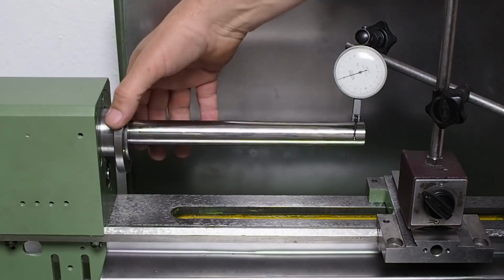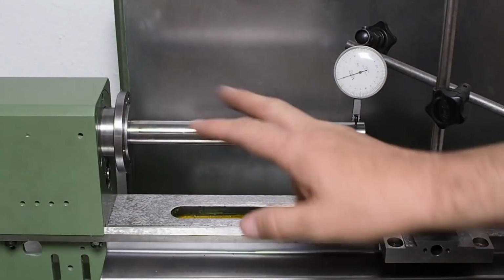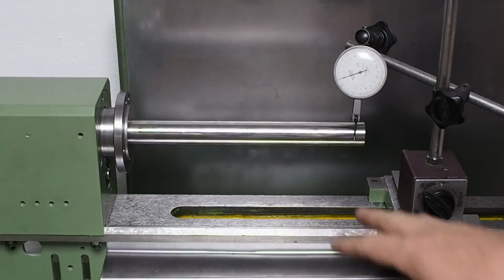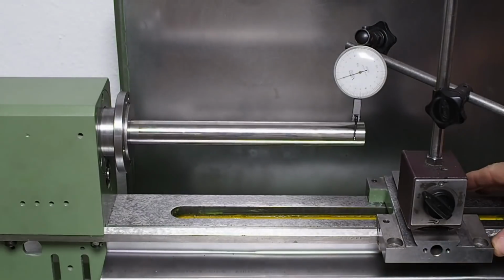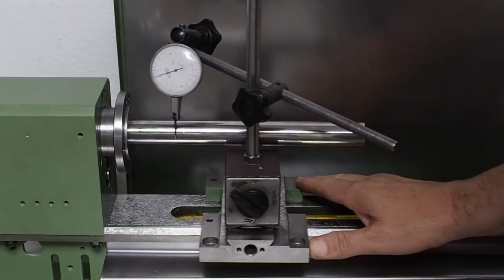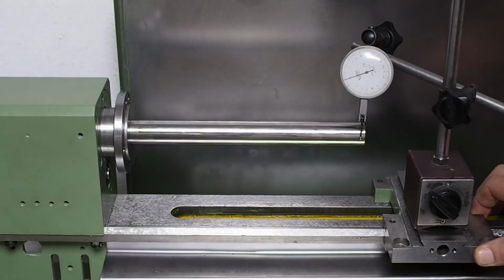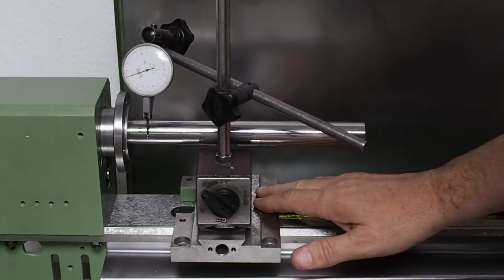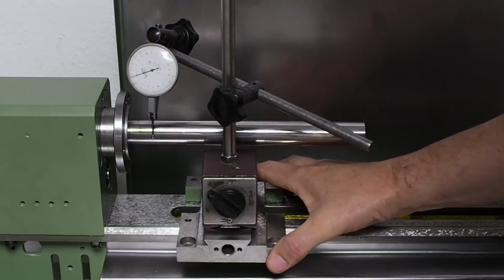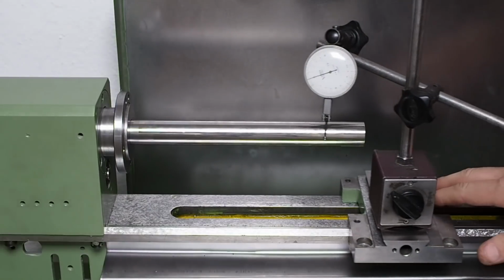With the spindle installed, I figured that before I do anything more, I'll bolt the headstock down to the bed, fit the test bar and just see whether this is still nice and straight or whether I've managed to pull the bed out of alignment by mounting it onto the stand. In the horizontal, it's looking fantastic. This is my most accurate indicator, measures 1/10,000th of an inch, and it's basically pretty much zero. Maybe 1/10th of drop along the length of it.